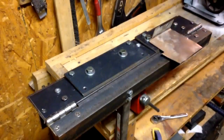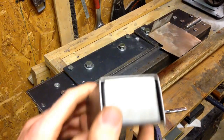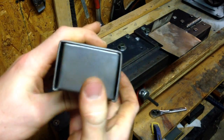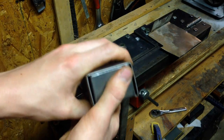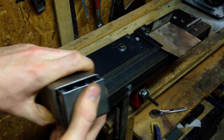These two surfaces — the surface where the sheet metal is clamped and the bending surface — they're not parallel. And that makes it move in a really curvy motion. It tends to pull the sheet metal out of the clamp, which makes my bends not accurate. Honestly, they're usually off less than a sixteenth of an inch. But these boxes are so precise in their tolerances and clearances that a sixteenth of an inch can make it so once you put the box in, sometimes it doesn't come back out again, and you have to unbend the whole thing to get it out.